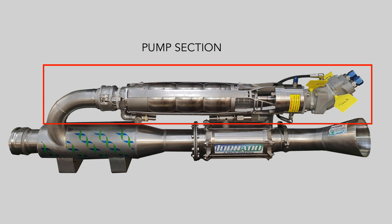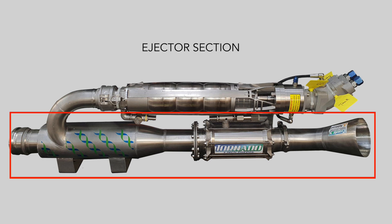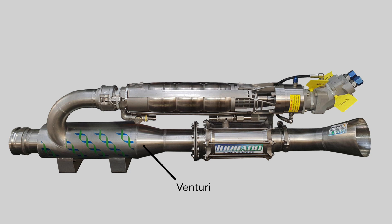When the water flow gets to the end of the pump section it's diverted both downwards and backwards in a gentle 180-degree arc into the ejector section. The water then enters a venturi — a tube-like constriction where large volumes of incompressible water are suddenly forced through smaller diameter bores, causing the flow to rapidly accelerate. As the water passes through the exhaust, it essentially pulls the flow of dredge water and any entrained sediment through the exhaust with it.